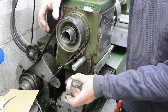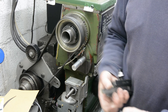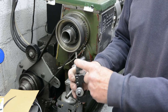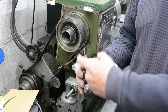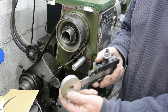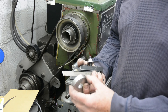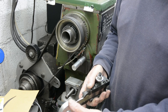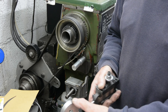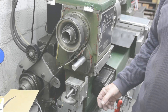It's very easy to make these pulleys for the poly V belt. The V's have a 40-degree included angle, so I've sharpened this parting tool to have a 40-degree included angle on the end. Then it's just a simple matter in the lathe of putting it in and moving it along — the spacing on the J belts I'm using is 2.34mm between each groove. I just need to do one groove, come along, go in the same amount, and so on. I've got five grooves on these, though you can get them wider.